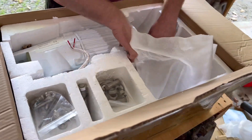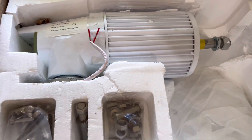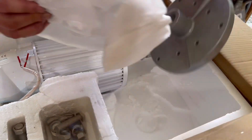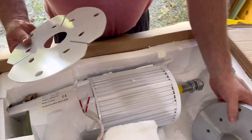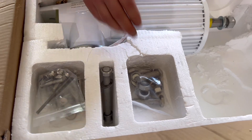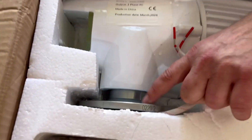And there's the generator. There is the blade hub. You got the blade hub back and then you got the flange clamp for the front of the blades. All stainless steel bolts — that's good. There should be four — yeah, these are the four for the flange mount to the top of the wind turbine. And I guess these are more stainless steel bolts, and there are some nylocks.